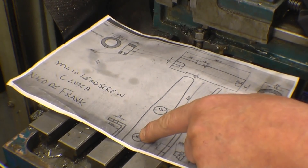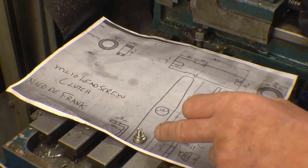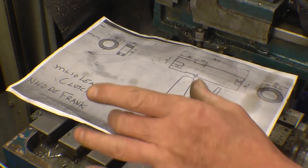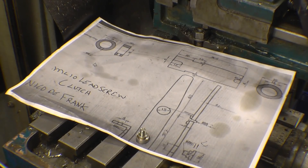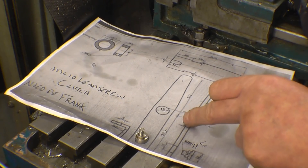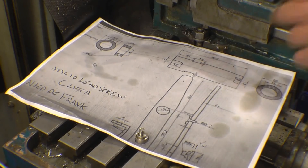I need to put a 10mm hole in the bottom of here for that little screw we made to go through. I haven't got the distance between these two holes — it's not on the drawing, so he'll have to do that himself once he makes the little bottom bracket. That hole where it says 13 is actually the width of the little adapter I've got to make that fits in that slot. I think it's just held in with a 4mm nut.